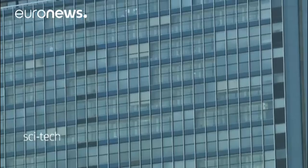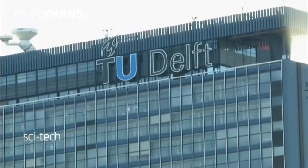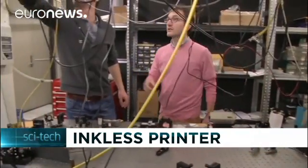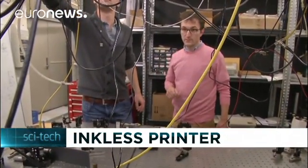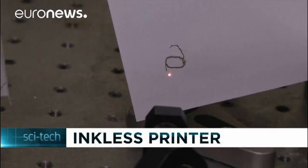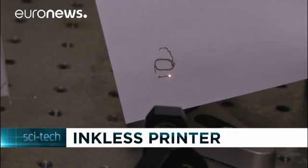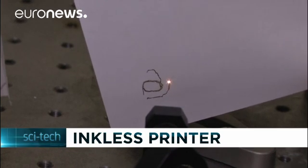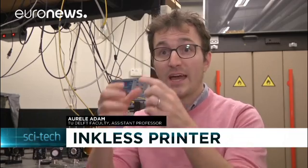The technical word to describe this writing system is carbonisation. The tricky thing here is to create the optimal balance between the laser beam intensity and the type and structure of lenses to turn paper carbonisation into a print dot, but not to start any combustion of it. In order to control the burn of the paper, we have to have an intensity which is very uniform and only at the area we want to expose with the beam.